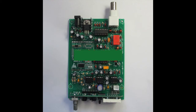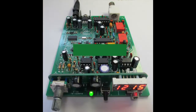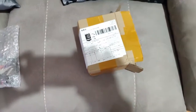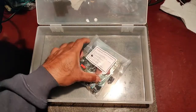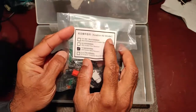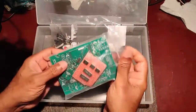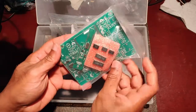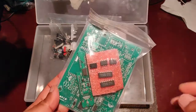This is the upgraded version of the R80 receiver — a combination of an FM radio and an aviation band receiver. This is the packaging it came in, and the number on the PCB is HM00ABRC underscore 7. The old one — the popular revision 6 that's been well documented on YouTube — is revision 6, and this is revision 7, which has no connection with the other one because the chipset is different and the schematic is totally different.